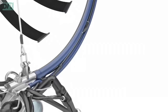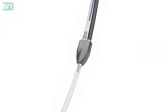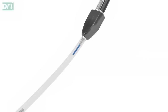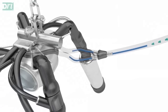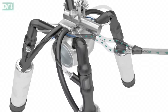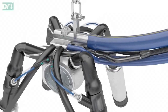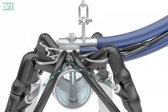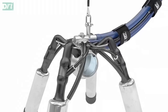The cluster is then removed smoothly from the cow when the vacuum is cleared and is left in the normal parked position. After the cluster is removed, the teat cup is sanitized and rinsed repeatedly with the compressed air and water. Dip residue on the inside of the liner is rinsed out and the entire liner is sanitized to provide a clean liner for the next cow.